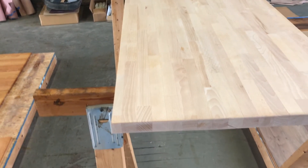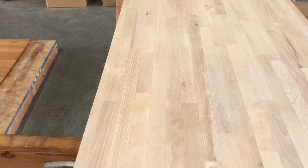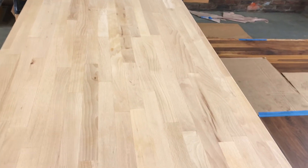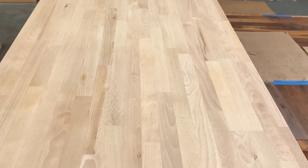We're back at our countertop project — we just finished our sanding. You can see a couple of spots after we wiped it down with mineral spirits. To summarize: we had finish on here already so we started at 40, worked up to 60, then 80, then 100, and finally 120 for our final sand with the Festool random oscillating sander. We followed that up with a hand sand — 120 grit on a sanding block, going with the grain to eliminate any swirl marks. Then we vacuumed it off, wiped it down with mineral spirits, and we're ready to coat. We always recommend a final sand between 100 and 150 — I usually stop at 120, as that keeps the wood nice and open.